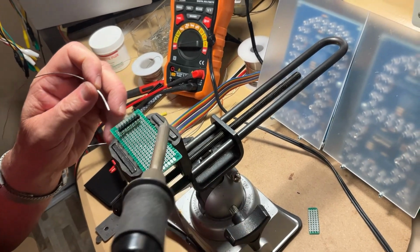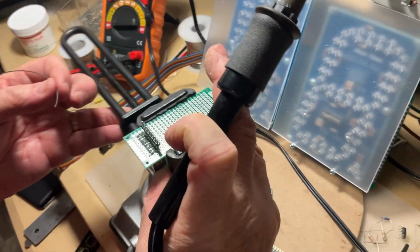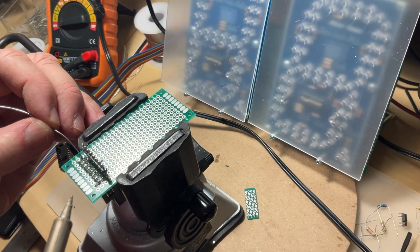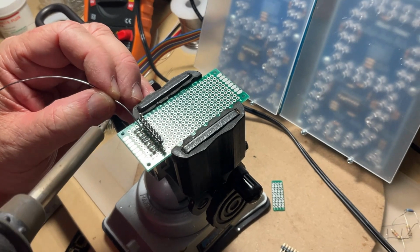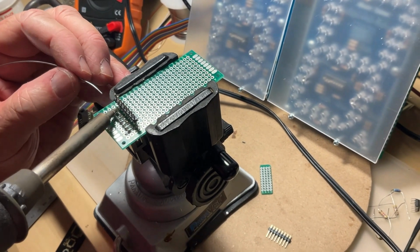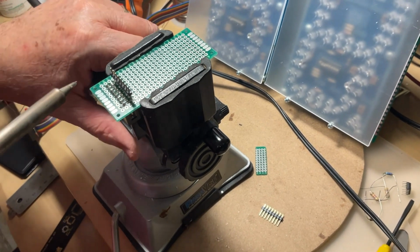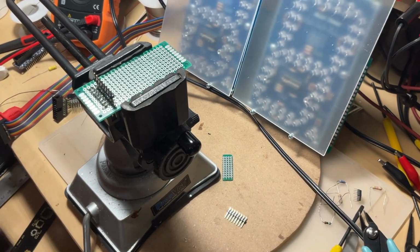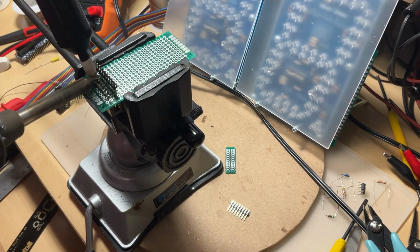And once they are soldered, remember what the job was. The job was to solder the inner contact to the external one together. And because we are already here, we're just trying to be careful, because sometimes you're going to solder more than you need. So yes, you may need a little desoldering pump to make sure you're going to fix the problem.